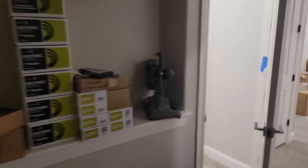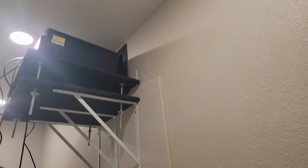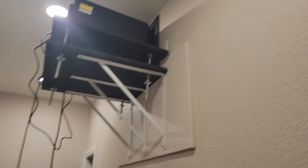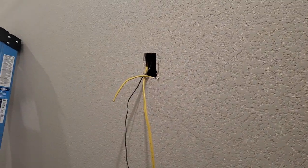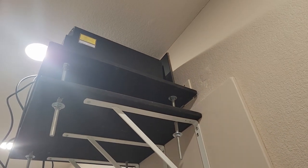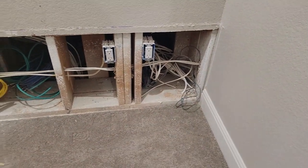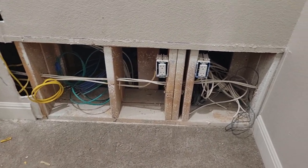And then duplicate the same thing on the other side of the control room — this control room has two entrances, so basically duplicate it over here. The 12-volt trigger will come from the processor over there to turn the projector on, and there's a wall plate connector there. It will send that 12-volt trigger down to where I'll put some kind of a box with a relay so that 12 volts will turn on the AC power, which goes up to this exhaust fan I've installed. It'll be pulling cool air from the front of the projector across to vent up into the attic. This is all stuff for whole-house audio — 11 zones — but it's a very low priority compared to the theater.